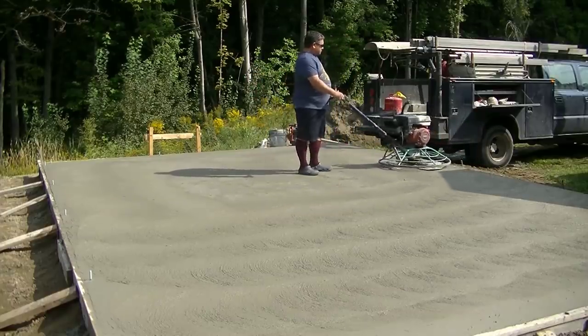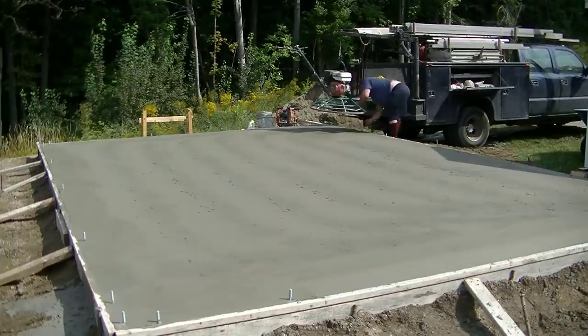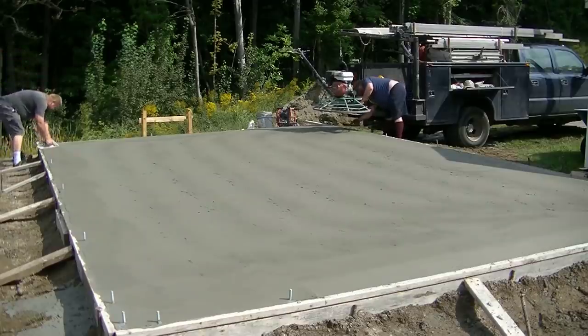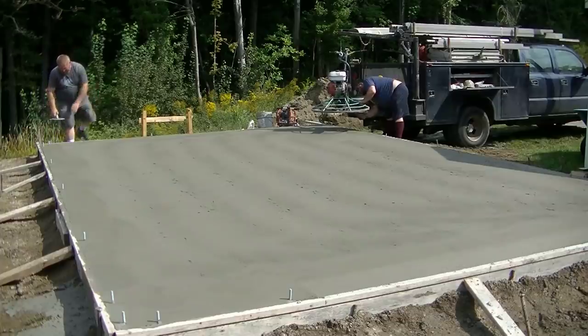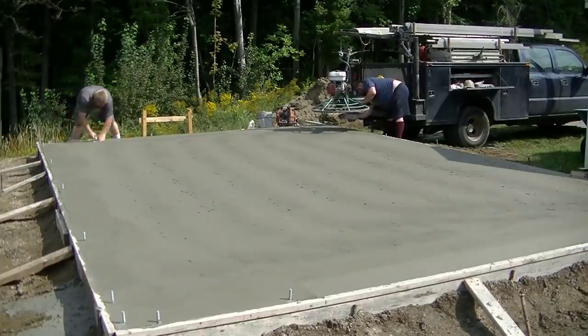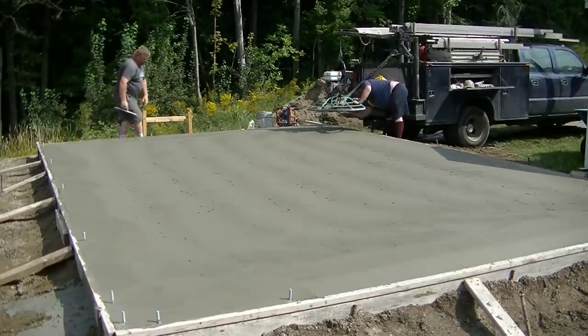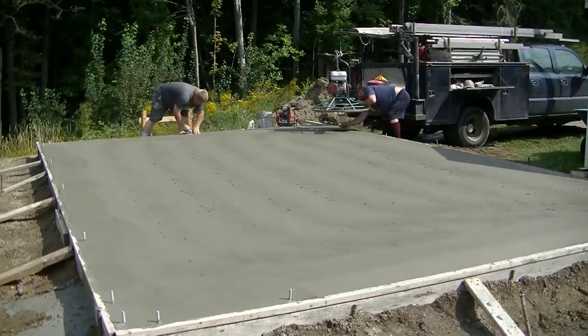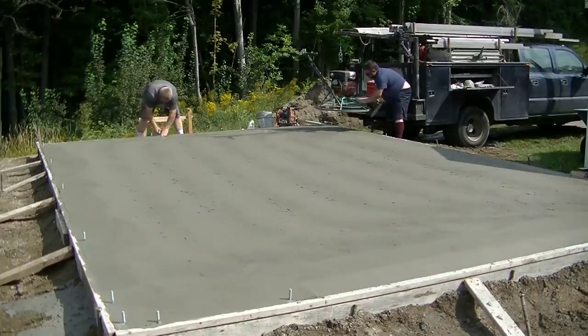You could finish a slab like this by hand too, but it was 90 degrees out today and hot in the sun. Eric actually hit it twice — you can see how he crossed his pattern and went the other way, and you can see how nice and tight that ended up being. Right now he's got it up on the crane, pulling those blades off and cleaning off the concrete slurry that gets on the trowel before he starts using the finish blades. He'll get that cleaned off and drop it right back down in about five minutes.